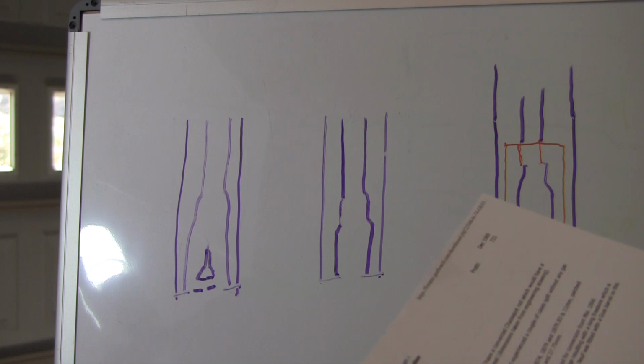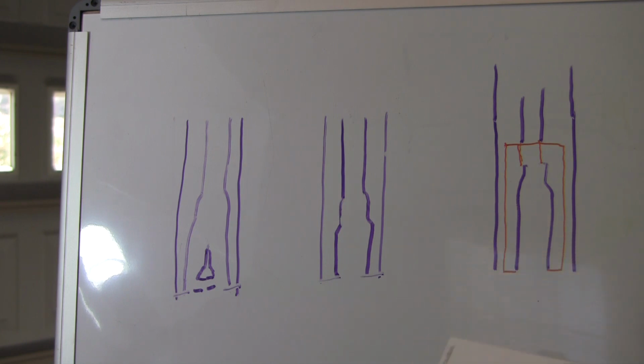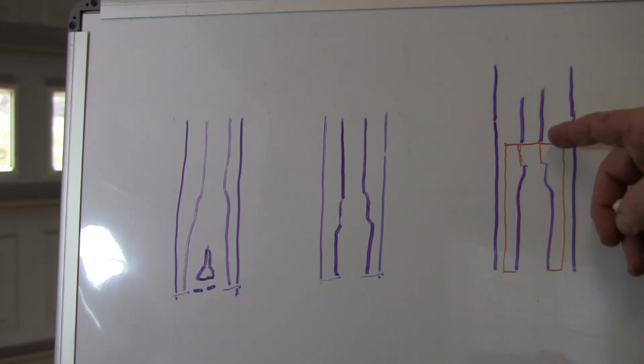And it's about 27 millimeters, or 1 inch 63 thousandths, from the end of the chamber to where the rifling starts. So what they did is they made this diameter 439 thousandths, which is a lot smaller than the groove diameter. If you're trying to put a bullet in there, a 458 or something, 439, it's a big difference. So there's that little 1-inch gap you're jumping.